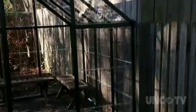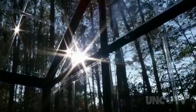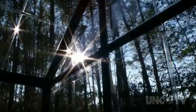But folks, you can do a lot of things to conserve heat loss that's built up during the day. And here are a few simple approaches. First, you can see this greenhouse is placed up against a fence. Now the fence is on the north wall. That's going to help protect against some of the prevailing winds, those northwest winds. And in addition, it's somewhat dark colored. So as the sun shines in the southern sky, it'll heat up that wood and it'll radiate back at night, keeping a small layer of air somewhat warm, kind of an insulation, if you will.